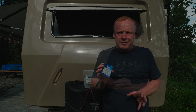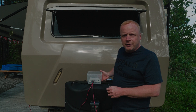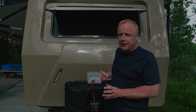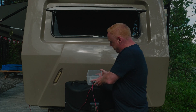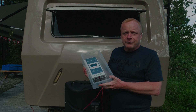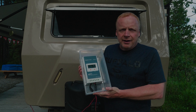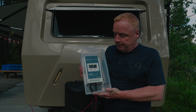Not so adequate when you're adding a second panel. We purchased another controller that handles two panels and works a lot better than a PWM. The controller you want is an MPPT controller, available on Amazon — it's different technology from the PWM.